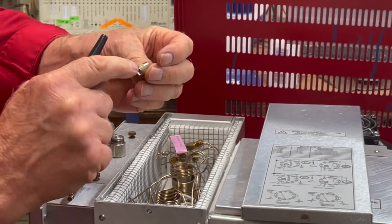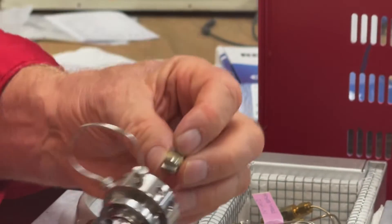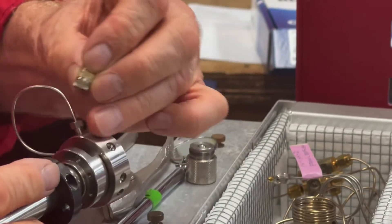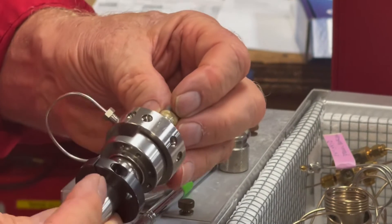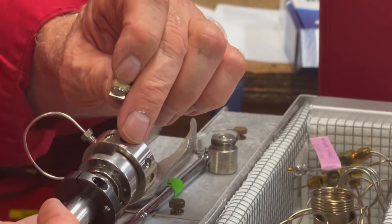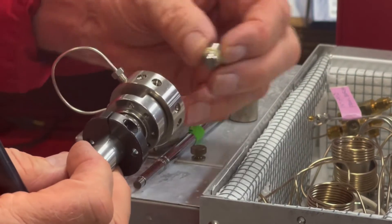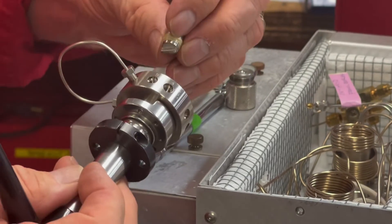The rotor has five tiny little grooves machined into this Teflon part, and the little grooves line up with the holes on the outside of the valve. So when the valve rotates, this hole which is now connected to this hole changes so that this hole is connected to that hole — every hole switches neighbors. It switches to its left neighbor or its right neighbor.